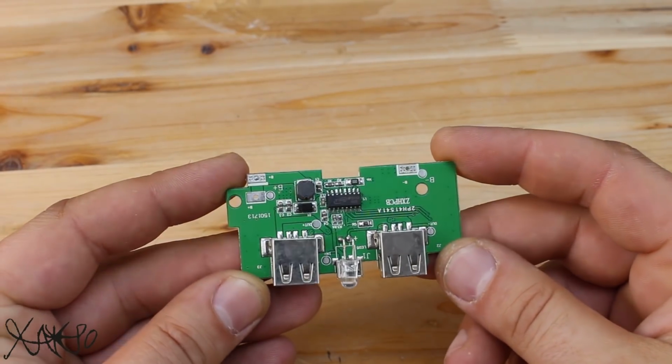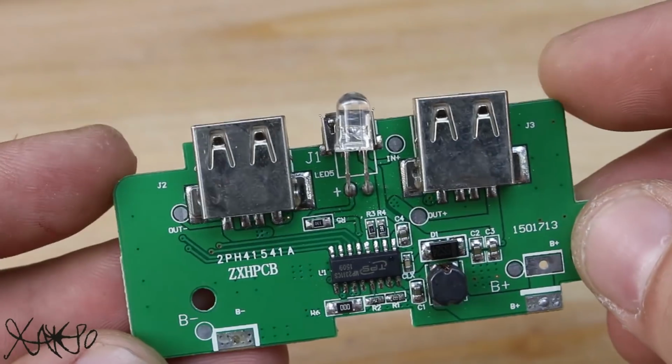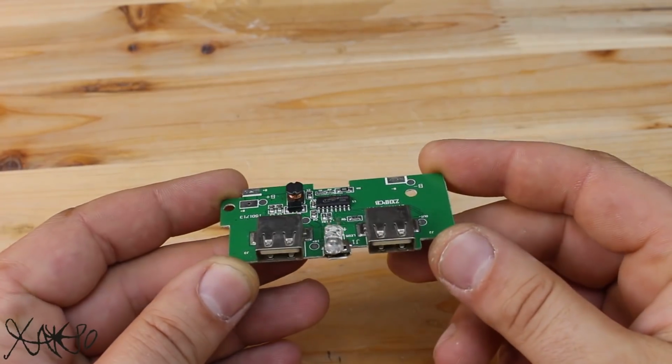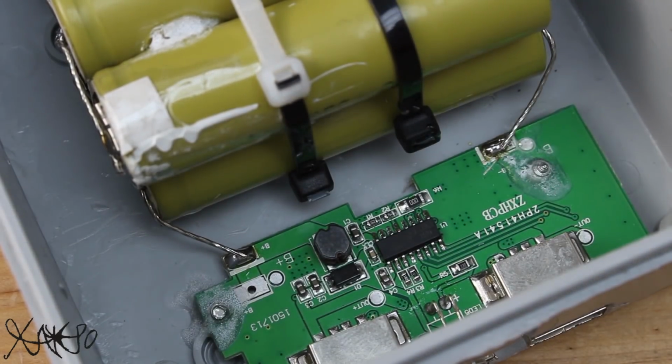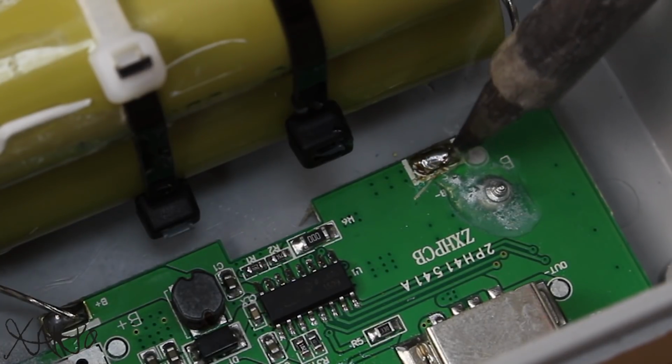The voltage regulator, DC booster and lithium-ion charger all in one board module is a cheap board that I purchased from eBay for about $4. Link below. It can be more simple than this. You need to solder the positive wire from the battery to the positive terminal of the board and do the same with the negative wire.